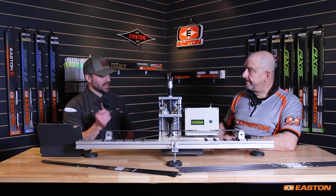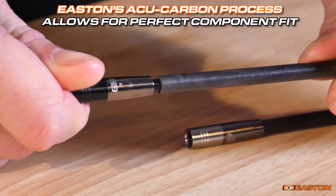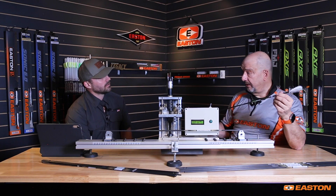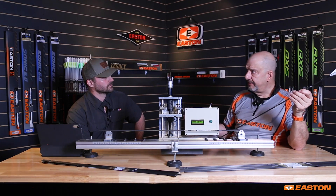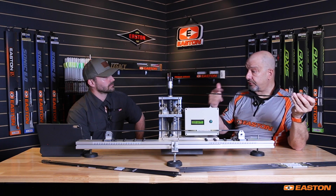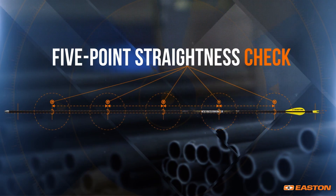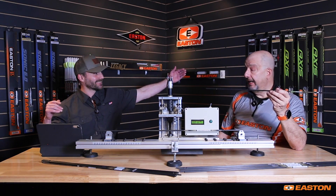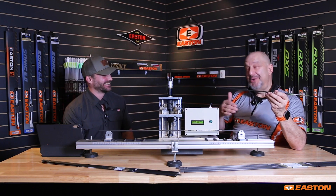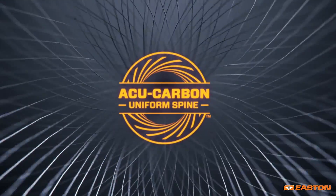The quality control coming out with the AccuCarbon process also means perfect component fit — you don't have to sand down anything, all components match right up. Because it's a continuous process, there are no hooks or bends at the ends of the arrow. With a lot of wrap-and-roll carbon arrows, you actually have to cut off the ends to get a straight running broadhead or target point. You don't have to do that with Easton. Whether it's the center or the end of the arrow, it's the same straightness all the way across. There's one beginning and one end — 10,000 arrows later, if you didn't cut them off, you could end up with an arrow that's seven miles long. That is a characteristic that no one else in the industry has. Easton took the shortcomings of carbon and built them as a strength, optimizing carbon fiber in a way no one else in the industry is capable of doing.